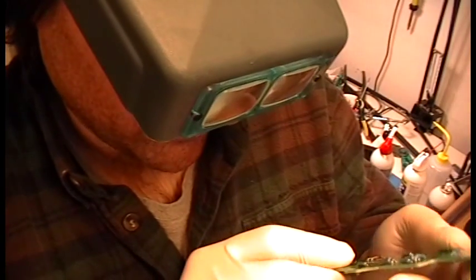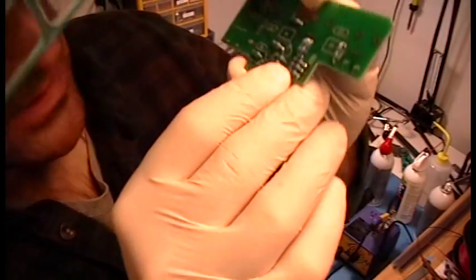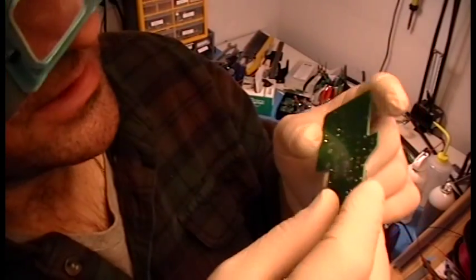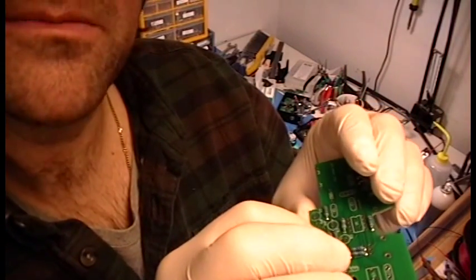In this case, I didn't look, but I was pretty confident that it did, because I could tell as I was soldering. Yep. All these joints are great. There's one joint here that's okay. That joint right there, see? It didn't quite cover the entire pad. That's actually an acceptable joint. It's okay if it shrinks back a bit on the back side of the joint.